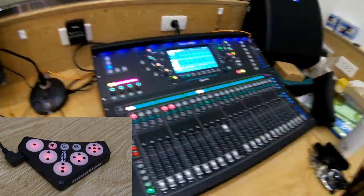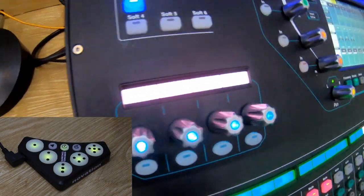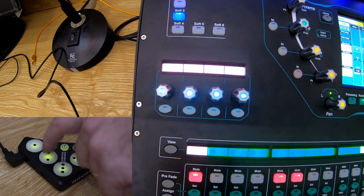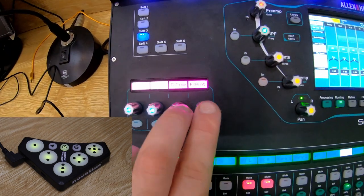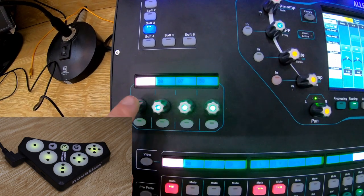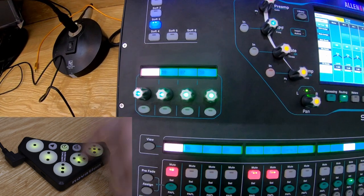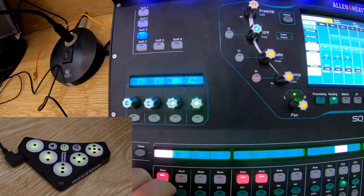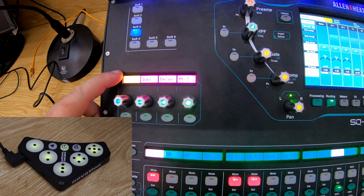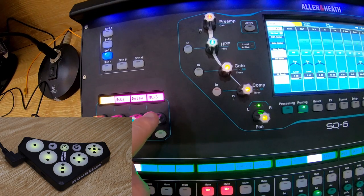The green layer I've set up to be my soft rotary layers — I'll leave a link to the video on how I set those up at the end. My first layer is my AUX send levels and assigns for any selected channel. My second layer is effects sends and some effects parameter controls. My third layer is my four main vocal microphones with fader control on the buttons. My fourth layer is AUX master levels with fader control so I can hear what the stage hears. My fifth layer is the master section with mains, a fader and subs, delays, and front fill with mute buttons.